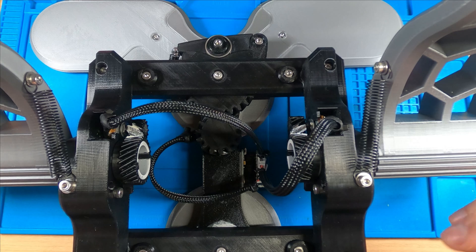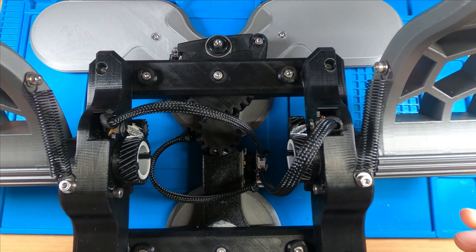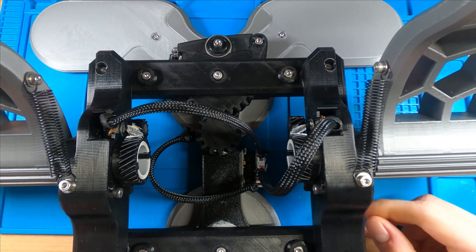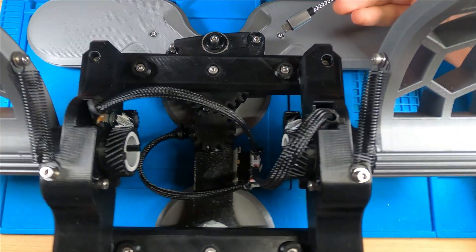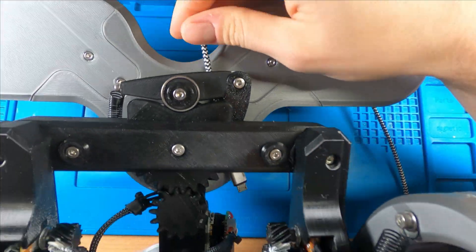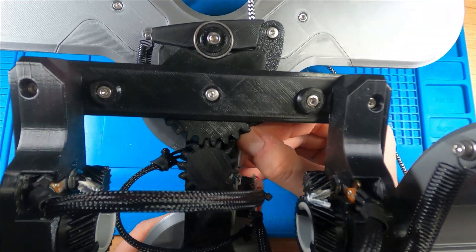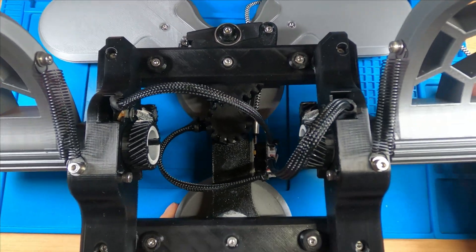You can see the complete wiring diagram on the Arduino build page. I promise, if you can operate a soldering iron, you can put this together in under 15 minutes. I used some mounting tape to fix the Arduino here. Our micro USB cable will slide neatly right under our tensioning arm through that little gap, and it can be plugged right into our board just like that.